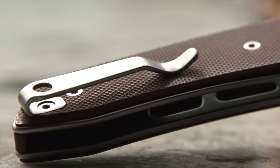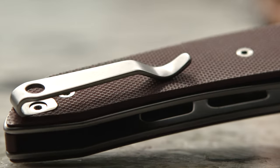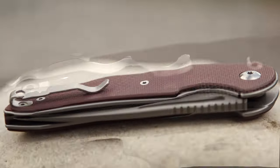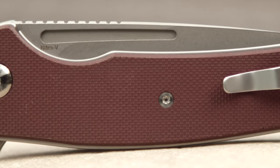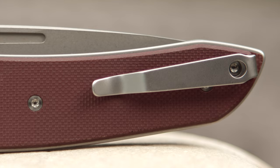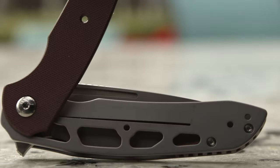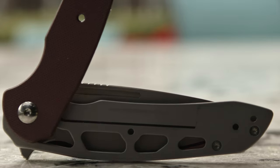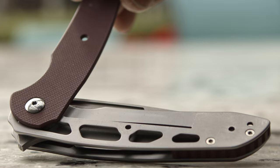The clip is utilizing a single screw mount and in this case the G10 has been milled out so the clip and screw are both recessed. The clip is right hand tip up only, which I believe is due to the ingenious direction Fair and Forge took to minimize the exposed hardware. The visible body screws merely hold the G10 to the actual underlying frame, while the hidden screws tap into the standoffs and hold the spacers placement along with body pins which provide the Stinger's true rigidity within the build.